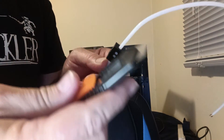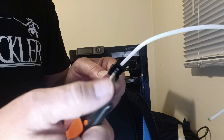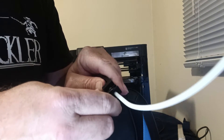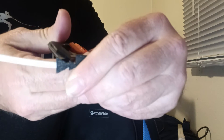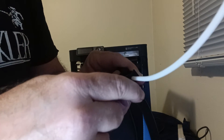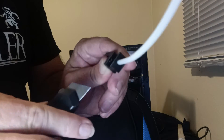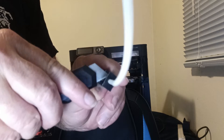I'm just going to take my utility knife out with just one full blade, and I'm going to slot it in here, parallel with the edge of the plastic guide. We're just going to cut a notch in there — so it's just going to be one there, one there — and we're going to cut straight down: one, two.